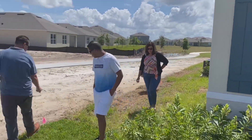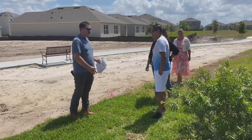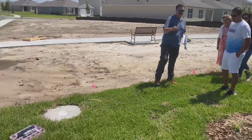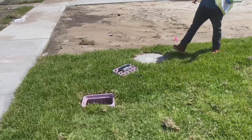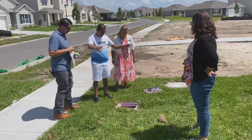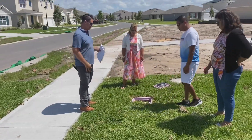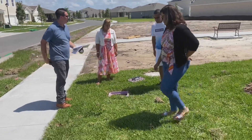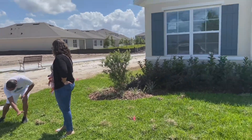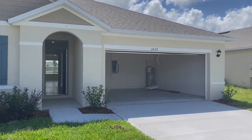You'll have these purple footers — that's just to signify that it's reclaimed water. All of your sprinkler heads, other than where the trees are, have just a really small hose that just drips. This is the meter for your sprinkler system. I saw a big pool of water here — this is eventually going to cause the dirt to keep sinking and become a problem.